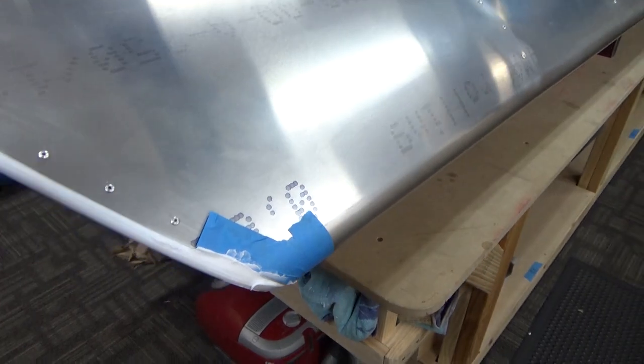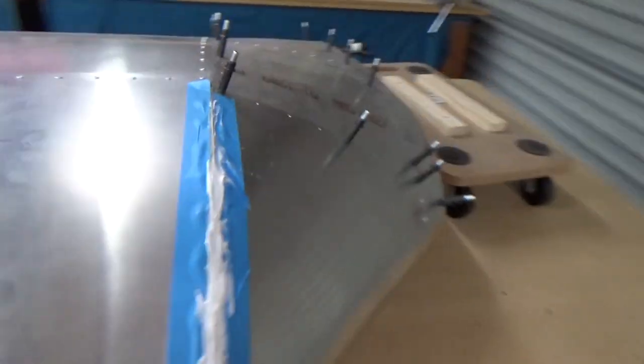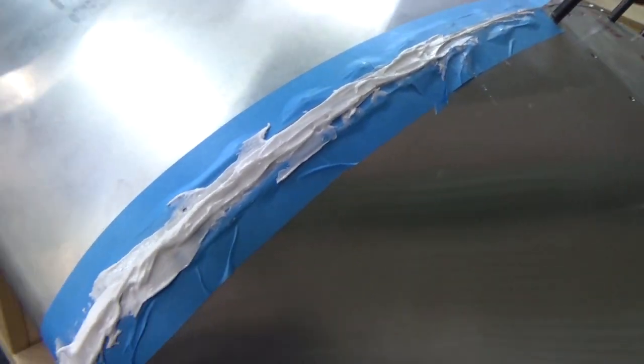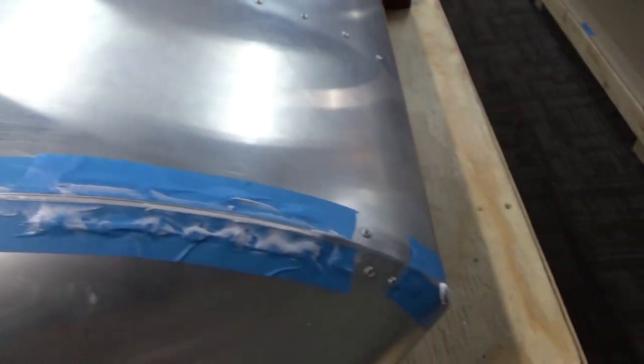Just a quick one - I've got the wing tip on and I've just gooped that up, so sort of halfway through the process. The join scooped up, added the extra wing tip, and I've also done the wing root rib. As you can see, I've just bogged it up there. On this particular part, fluffed up the filler just so it's high - because rather than go back later and try and add some more, it'll fill the gap. This side on this wing just needs a couple of touch-ups. This one's basically complete. I've decided just to fill the whole groove to make it like an aero seal.